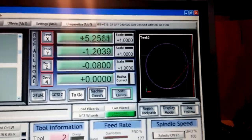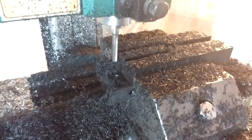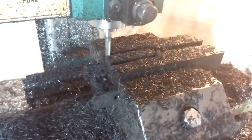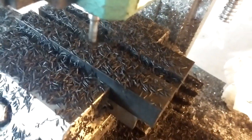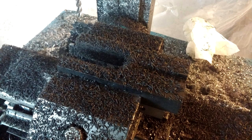Mach 3 interface. This is for the car door lock actuators — this is sort of a bracket. I'm cutting it out of Delrin. It's really odd; if you look at it, Delrin makes these chips as opposed to ABS plastic where it's melting off in strips. I think it actually looks kind of grody. I took a picture at the end — that's what it looks like after you're done.